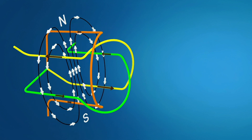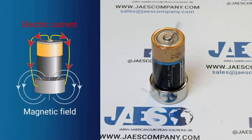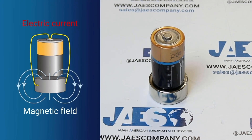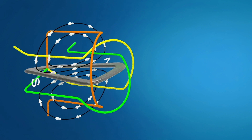We can call synchronous speed the rotational speed of the magnetic field. Let's try now to place a closed conductor inside the rotating magnetic field. Since there is a variable electromagnetic field in a closed circuit, an induced current will be created on the conductor. The rotating magnetic field will induce a current in the loop. The situation obtained is a loop subject to induced current, located in the magnetic field. Like we've already seen in our last experiment, the Lorentz force was responsible for the rotation of a tin wire placed over a battery and a magnet. The wire was immersed in a magnetic field and while electricity flowed into it, a perpendicular force acted on it, letting the rotation happen. Also in this case, an electromagnetic force will be produced on the loop, allowing the rotation of the connected rotor.